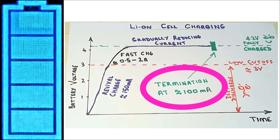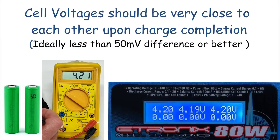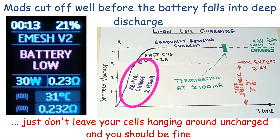Maybe disconnect the charger when it's fully charged, so we're not relying on the charger to actually do it for us. And if you're using multi-cell packs, then just periodically use a multimeter to compare the voltages of the charged cells to make sure they're being properly balanced. And of course if we avoid allowing the cell's voltage to fall too low, then we're not relying on the charger to correctly handle that restoration charge. These aren't really major safety issues, just a bit of common sense that'll help your cells have a longer life.